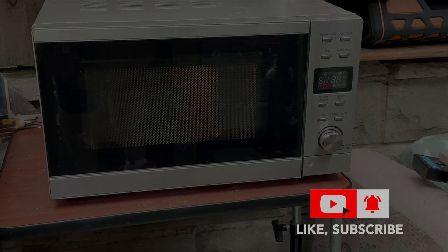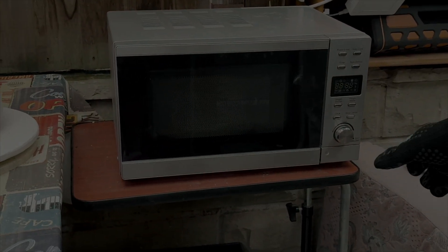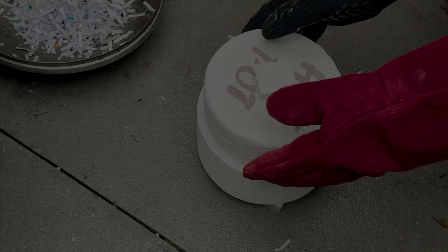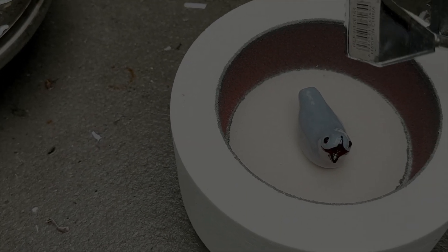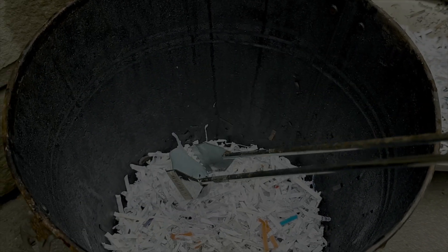Five seconds to go — Mark has his heat-proof gloves on and his glasses and we are good to go. We've taken the whole kiln close to the bucket on a little marble stand. What we're looking for is a smooth glow. If it's bumpy it's not hot enough. Then we place it in the bucket — in it goes — and we wait for five minutes.